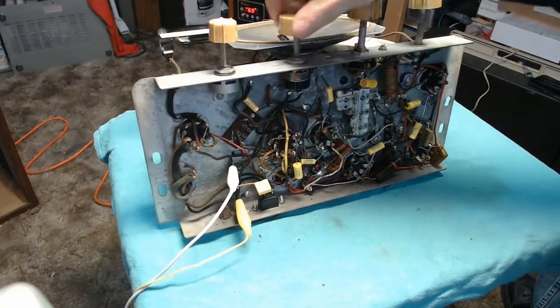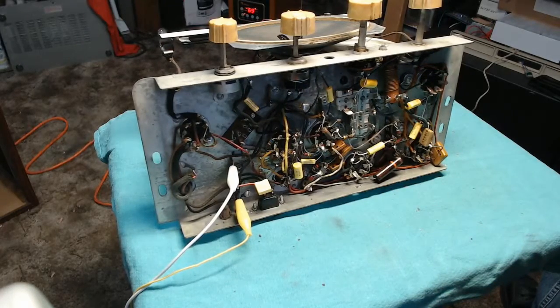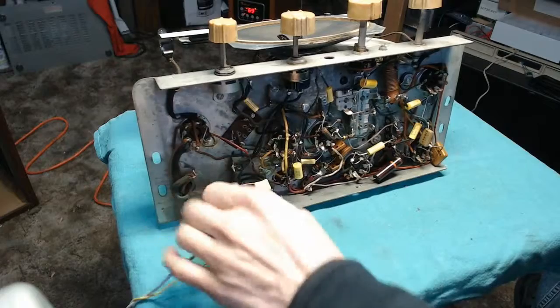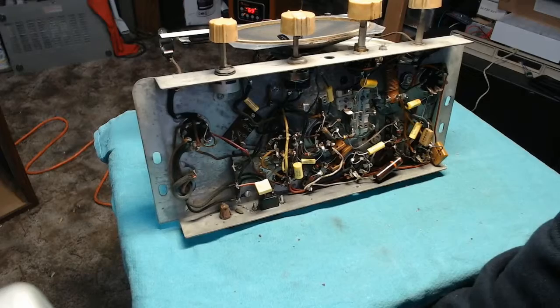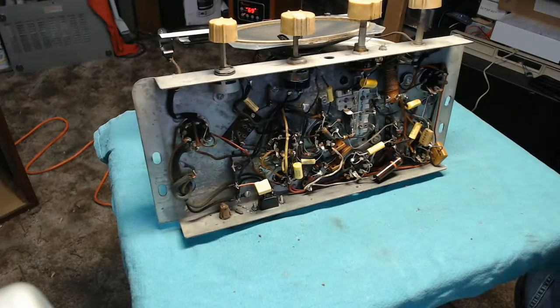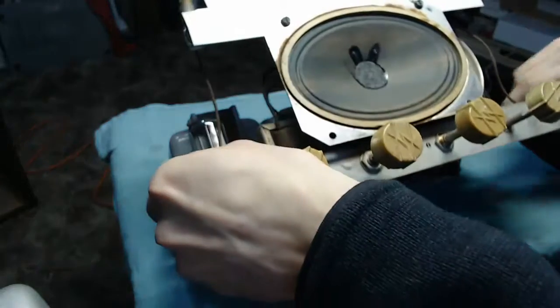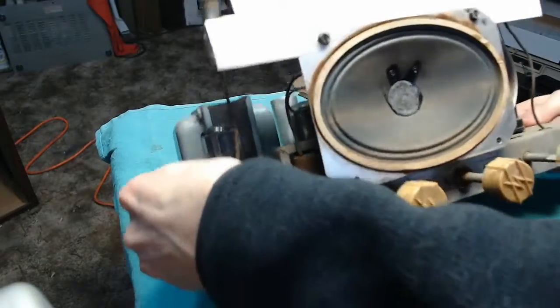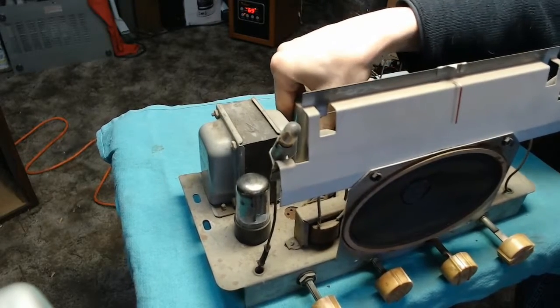And, yeah. Easy peasy. Rectifier and all the other tubes are obviously good. We got a nice clear audio output, but of course we are still going to replace the filter caps. Kind of have to, because if they're any kind of leaky, and I guarantee they are, they will eventually either fail open circuit or short circuit. So I'm going to give the canister a quick feel, because if they are bad, they will be slightly warm. Huh? Cold as ice.